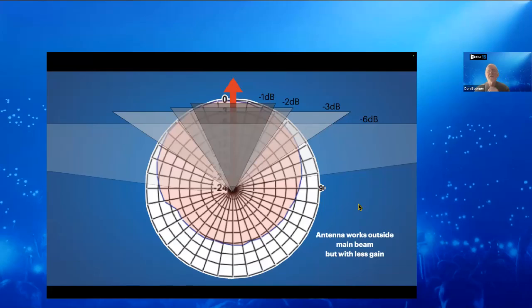120 degrees is about the rule of thumb for sight, for peripheral vision for human beings. So if you were going to put this antenna on a wall, put your head at that spot on the wall and look forward to where you're aiming it. What you can see is inside this field. Probably it's pretty close, right? If you can't see it, you don't have a direct line to it. You may get it, it may bounce off of something, but that's not a very good way to operate when you can avoid it. I would never plan a system that way. So, pretty easy. Wherever you've got your antenna, pretend that's a wall, put your head on it, look where you're aiming the antenna, and what you can see is what this antenna is going to cover.